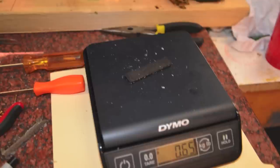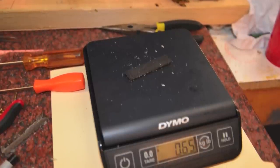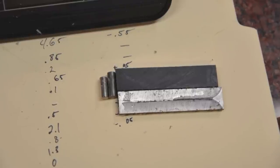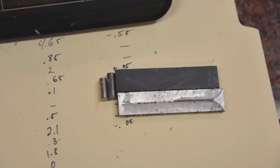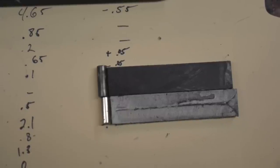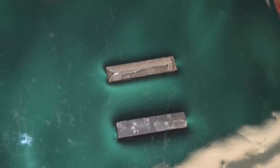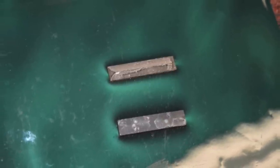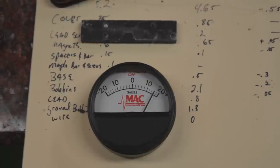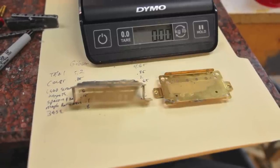Here's the weight of the Alnico magnet from Gibson: 0.6. And lo and behold, the Chinese one comes in at 0.65 — for a ceramic magnet. Big difference: what was supposed to be Alnico is definitely not; it is ceramic. You can see the strength of the magnetic fields here — ceramics on the bottom are much stronger. On the gauss meter, you can see how much stronger the ceramic is compared to the Alnico at the same distance.